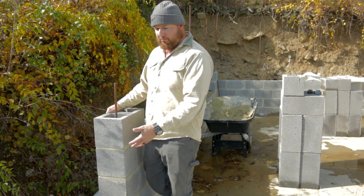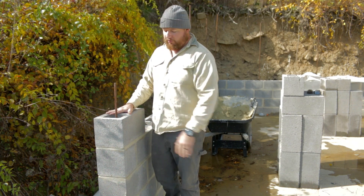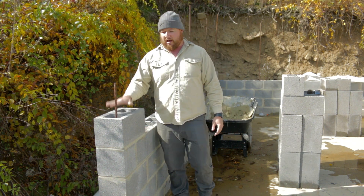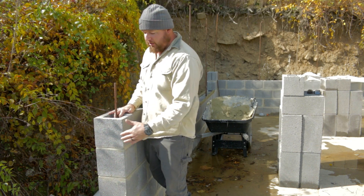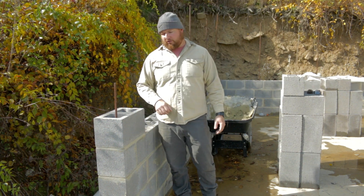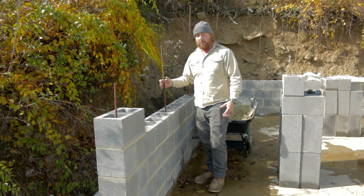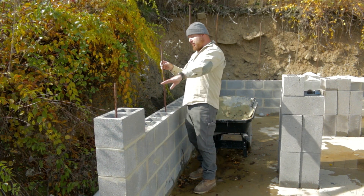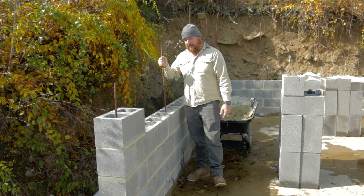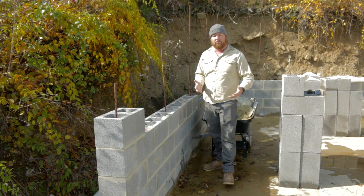Since our last bond beam, we have come up three courses. All three of these courses are hollow. This top one right here is going to be our bond beam. We have our cornerstones here — they're the flat-faced ones because we need to come against here with a board when we go to do our framing. We still have our rebar in here. Our rebar in the back came up, so this will be our second step — a little bit shorter. And then we come back to here, which is going to be our final elevation.